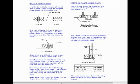On page 10 here I discuss holes in plastic parts. In order to facilitate the removal of a part from a mold, holes should be designed perpendicular to the parting line. It is not advisable to mold 2 holes at right angles to each other. The hole perpendicular to the parting line should be molded and the side hole should be drilled.